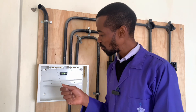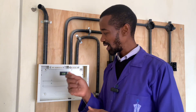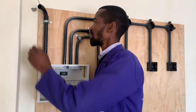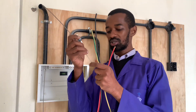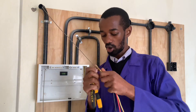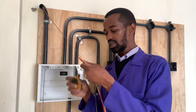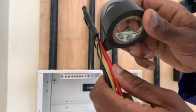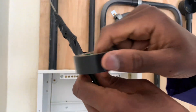If you want to pull the wires from the consumer unit, you insert this wire at the consumer unit and it will go all the way to the meter box. Once you have it at the meter box, you have someone connecting these wires. At the end of that steel tape, firmly attach those wires so that when they are pulled or fished or drawn, they will not disengage. Then tape it to ensure that it negotiates the corners properly.